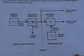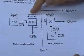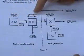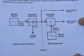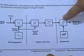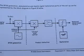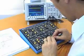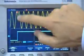Let's now take a look at a BPSK experiment in the manual. Start with a sequence generator. Clock from the master signals multiplied by our carrier signals gives us a BPSK. This is a typical block diagram. On the following page we have the BPSK generation, demodulation, filtering, then level translation of the recovered signal gives us the restored digital signal for demodulation. Let's now build the BPSK signal. Start by clocking the sequence generator. Just like in the textbook, the student gets an immediate understanding of the meaning of phase shift keying.